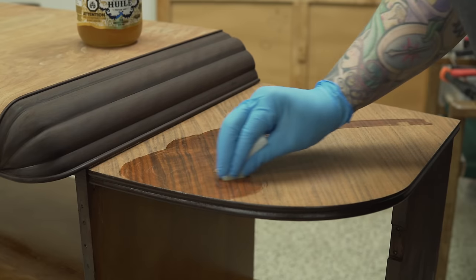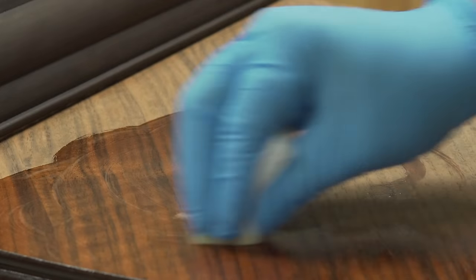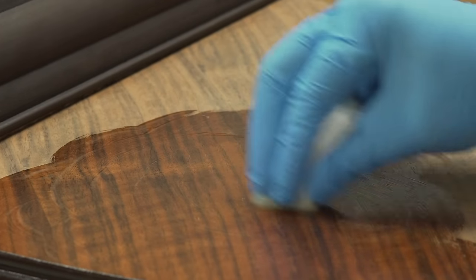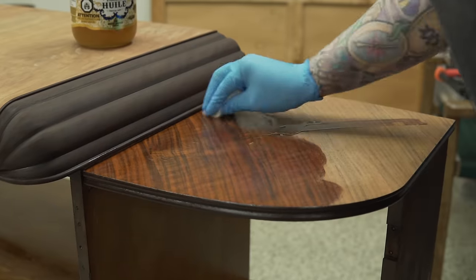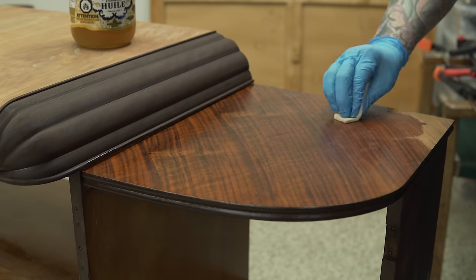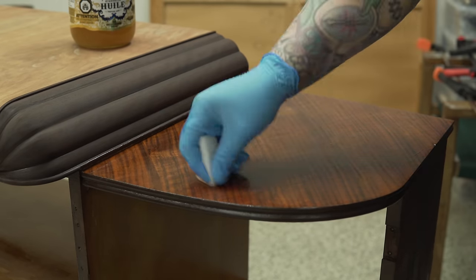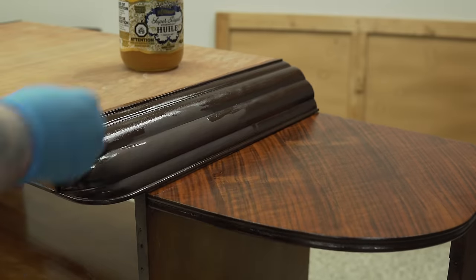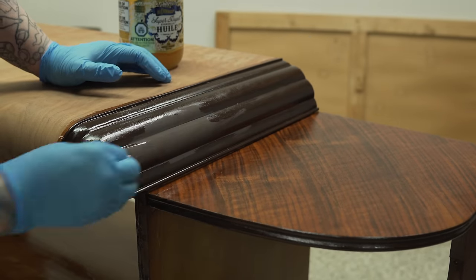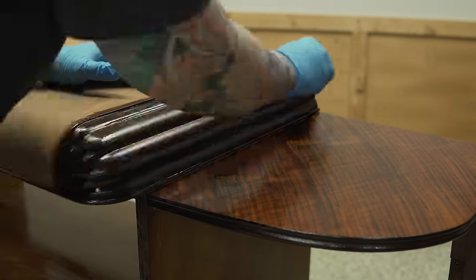If you've been around my channel for a while, you know that Odie's oil is one of my favorite products to use. It's a tung oil based finish. It's super, I want to say easy to apply, but it's also pretty easy to mess it up. So basically what you want to do is apply it with one of these little applicator pads, rub it really well into the grain, let it sit for a while, and then you're going to buff it off. And I mean all of it off. Not removing all of the oil is pretty much the only thing that can go wrong with this stuff.